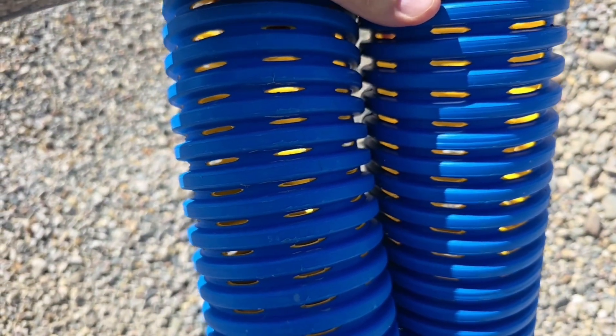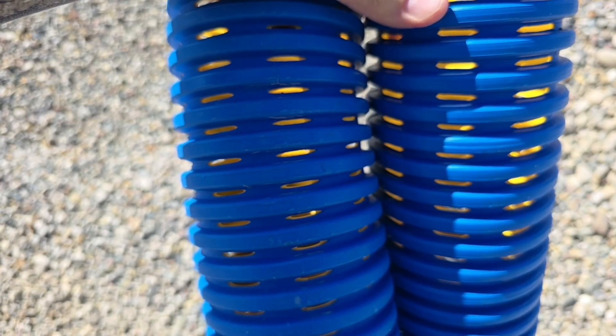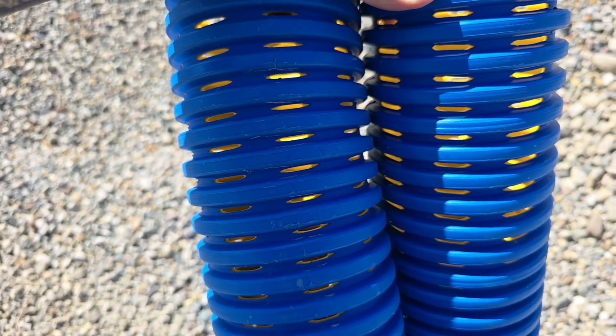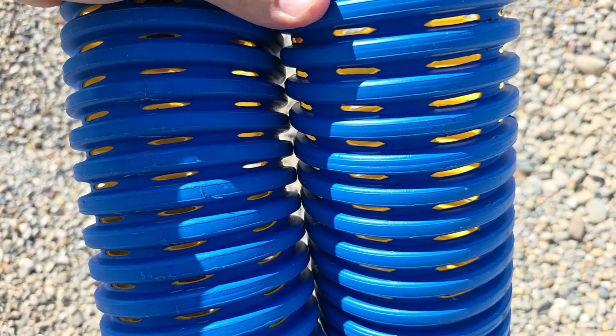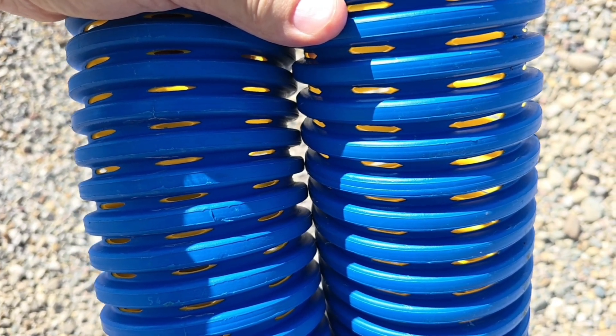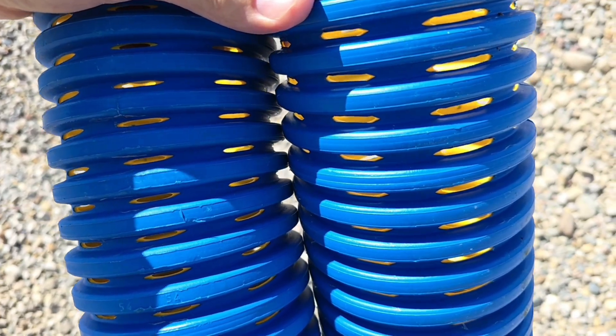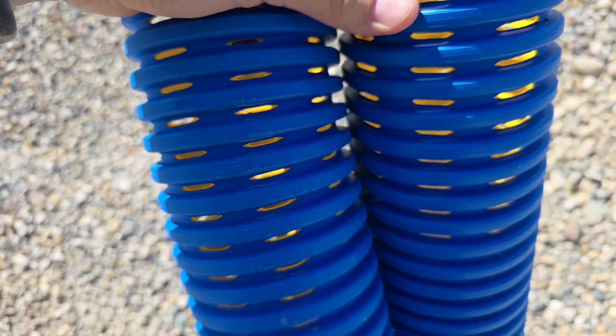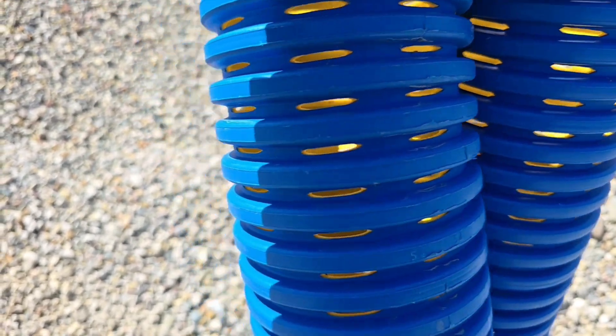The systems that I see fail are the ones where they put one pipe in the trench, don't go too deep, and run it extremely shallow — because they're trying to reduce labor, reduce haul-out, and reduce the amount of stone. Basically, they're not giving you your money's worth.